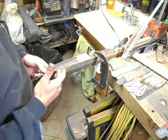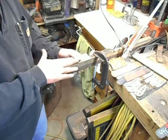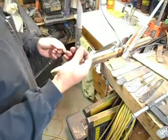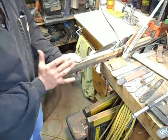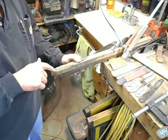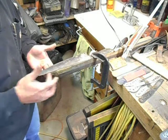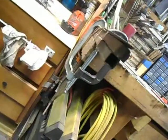I had it clamped up like this — this is just a quick demonstration. With this clamped up like this, you can see right off the bat the problem: a 2 inch wide blade on a 1 inch wide stick. The reason this stick right here is at a point is so that normally, like this is the blade we're going to hand sand today, you can put it right on there — it's less than an inch wide — and that point can line up with the point on this. So if I accidentally go into it, that stick right there is going to protect my abdomen from the point of that knife.